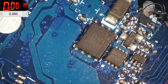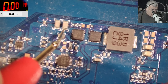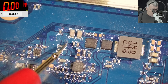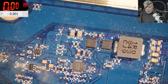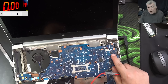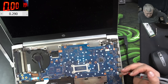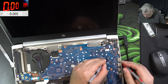I don't understand why the main power rail is missing. Maybe we didn't check it properly. The main power rail here is zero volts. I'm confused — the main power rail is missing. After the second MOSFET we have the main power rail, plus capacitors, and it's zero volts. We have a current sensor, and after the current sensor there should be a track.